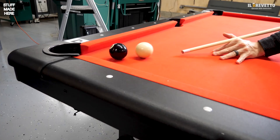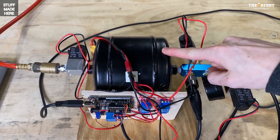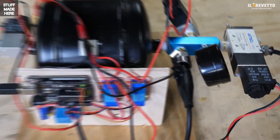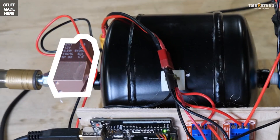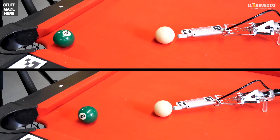Not all shots are done at maximum power — we need a way to vary power from a gentle touch to a battering ram. To do this I built the power pack. This tank is normally intended for car horns and has a microcontroller attached that measures pressure with a gauge. If pressure is too low it opens a valve to connect to shop air and pressurize the tank; if too high it releases pressure. To fire, I open a third valve. It's really simple and works well.